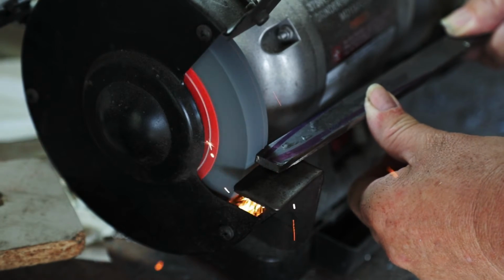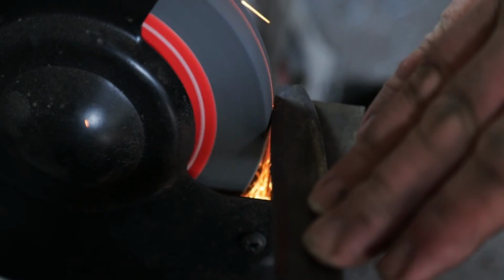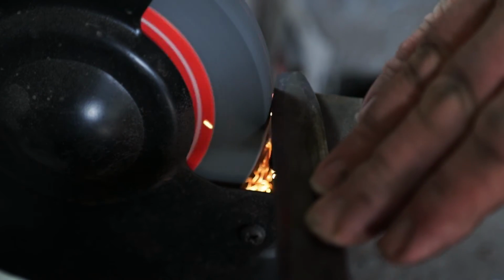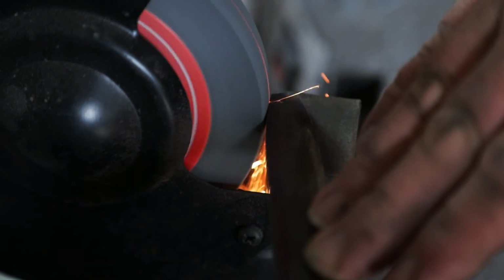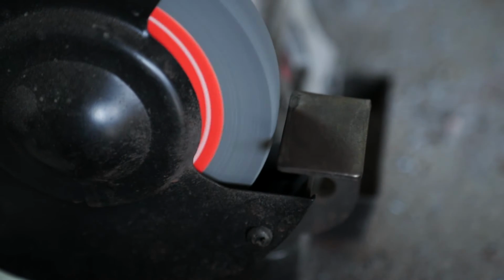You then make the edge of the blade, and you then make the taper of the blade, because the blades aren't completely flat, they taper down towards the point. So you then hammer the taper in. You end up with a knife at that stage that's about 80% of what you want it to be.